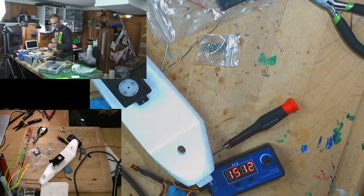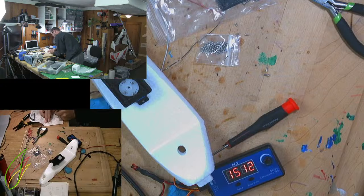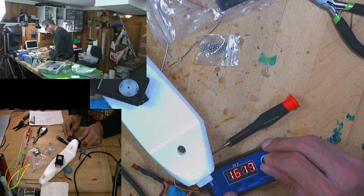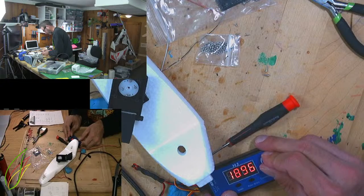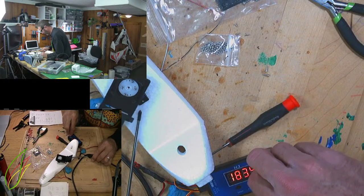1512 is center. Let's write that down. Pan. So we're going 1100 to 1512 to 1900. We may adjust the endpoints here. So let's go to 1512, which will be the center. Go to 1901. So that is that many degrees. Okay, so now we're going to go back.